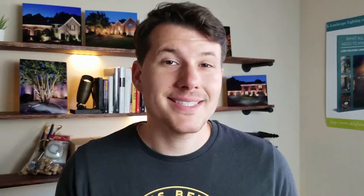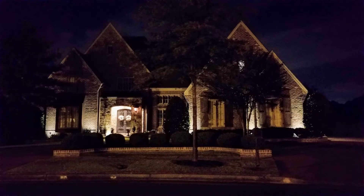The first con of a well light is that most of the time they are dim. It comes with a very large bulb that doesn't produce a lot of light. A lot of times when I see well lights at a home, instead of using a spotlight somebody uses a well light, and the overall effect is the light doesn't travel up the home very high. When you're standing back looking at the home it doesn't look like there's much light on the home at all.